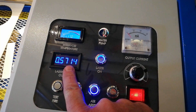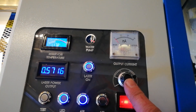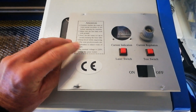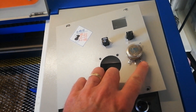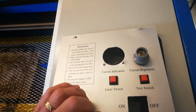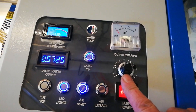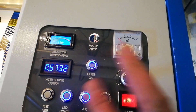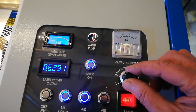This is very easily done. All you need to do is source the voltage across the pot. You can do it with a normal digital voltmeter. What you want is these two connections here on the pot. You can measure the voltage on the middle contact of the sweeper. On one side, as you dial up, the power goes down — that's not the one you want. You want the opposite one, where as you dial up the voltage increases.